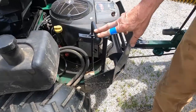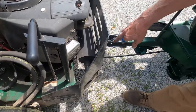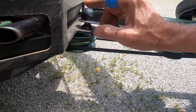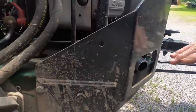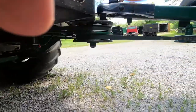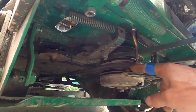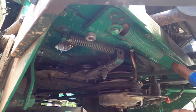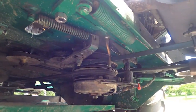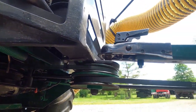This here was the PTO assembly that I rigged up on here. It just basically has a separate idler back here — a ball bearing idler with two pulleys on it. The top pulley goes to another pulley on the crankshaft of the engine that's right above the electric clutch that runs the mower deck. I just added a pulley in here. There's the electric clutch, here's the pulley up on top of that, and it's just a belt tensioner idler. Works real simple. And that drives this idler, which in turn drives this machine here.